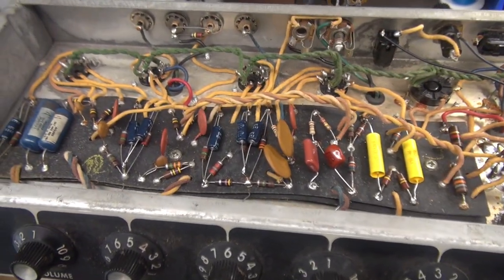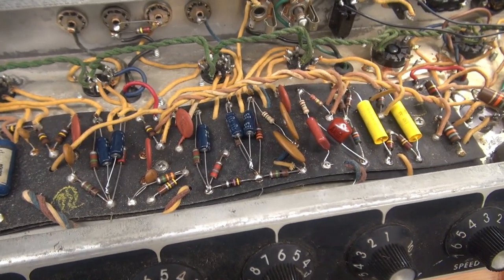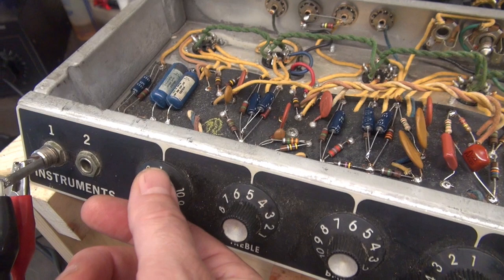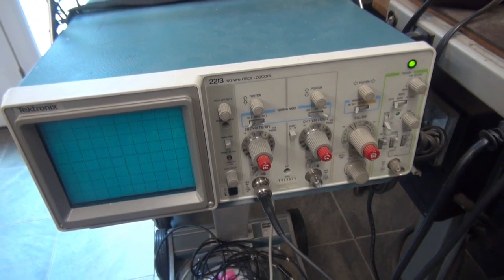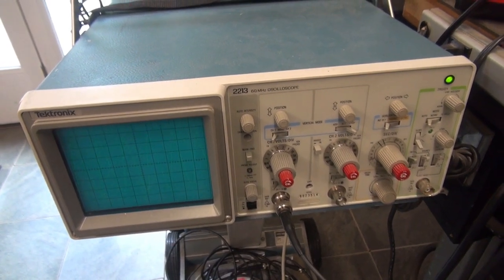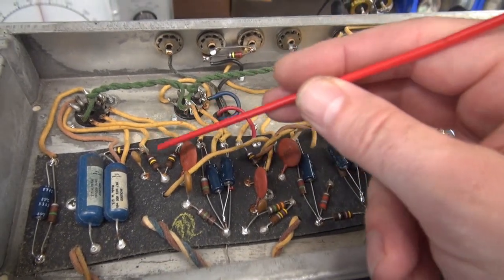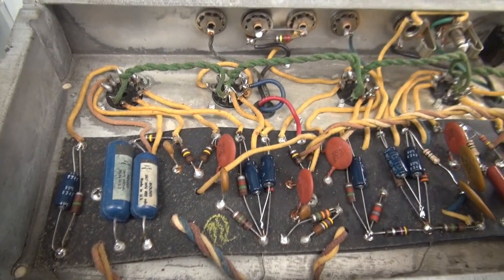I've changed out quite a few caps and I thought this would be a good time to re-verify the tremolo operation. I also found many resistors that were way out of tolerance, or actually the incorrect ones installed in the tremolo circuit — which is kind of odd. Somebody's been doing a little science experiment. Bringing up the volume — there's our signal. Here's the intensity for the tremolo, and there's the speed. So it looks like caps and resistors solved that problem. Next step: get these ceramic disc caps out of the audio chain, verify all resistors, and replace anything out of tolerance. I'm sure these 100K's are bad — they usually are.